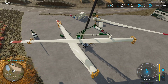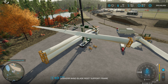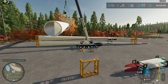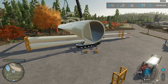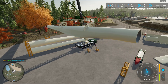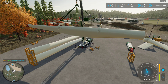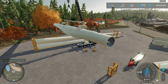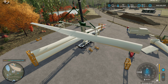This is definitely going to be very challenging to build. You notice the lift tool has half crescents, or half circles. What that's for is to be able to rotate the blade. If you lift it like this without any rotation, you can lift it all the way up to the hub. But with this, you can rotate it as needed to match the rotor attachment point. So if you have smaller blades and a crane capable of lifting both the hub and all three full blades, you can assemble it on the ground. Keep in mind that hub weighs 50,000 kilograms.